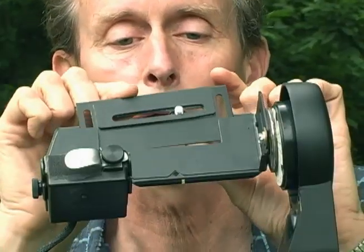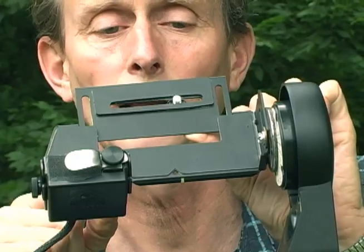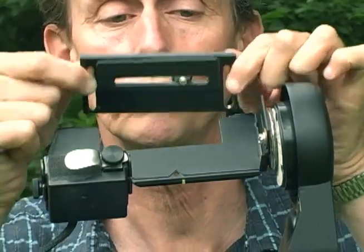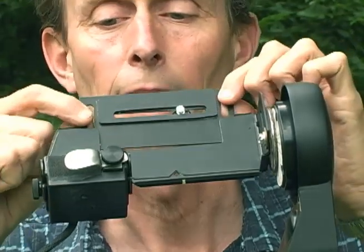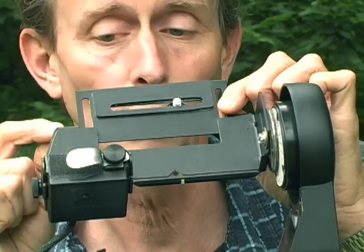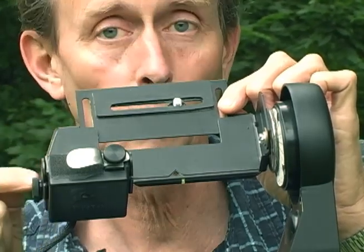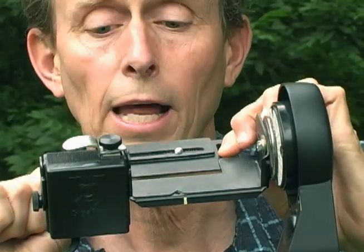The camera tray on the Epic 100 has this part which slides back as far as these two slots allow. So all I had to do was make those two slots a little bit longer by something like 5 millimeters, and that allowed the whole thing to slide back farther, and now I can mount that 55 to 200 millimeter lens zoomed all the way to 200 millimeters at the nodal point so that there's no parallax error at all.